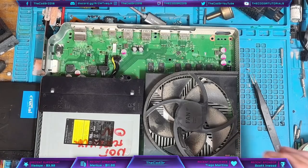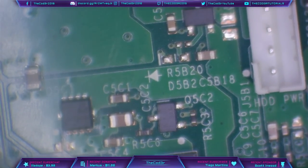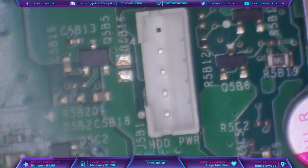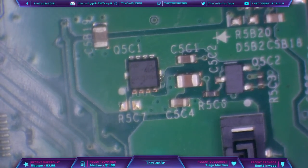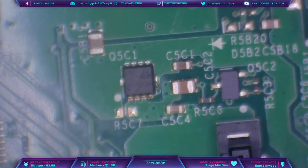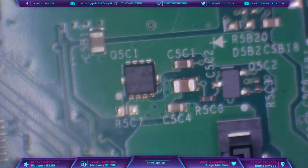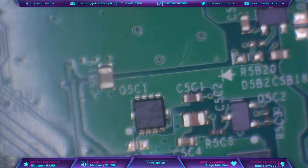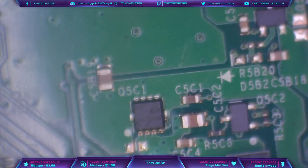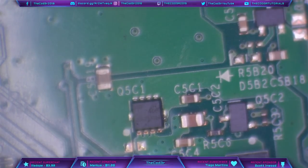Let's pop into the microscope. If we take a look just around here, you'll see we've got the connector for the disk drive and the connector for the hard drive — hard drive power and disk drive power. When I hook up my bench power supply, which obviously doesn't have the circuit protection that the Xbox One power supply has, I notice this area is going to get very very hot very very quickly. It's an area I've never noticed before, so I thought I'd start recording — it's very peculiar, I've never noticed this kind of issue before in this particular area.